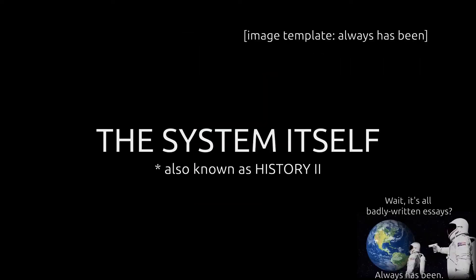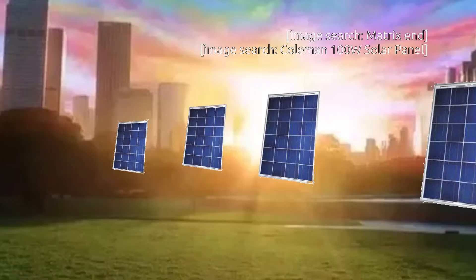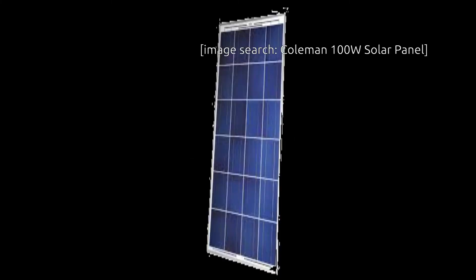Over the years I keep accumulating solar panels to fill up my windows. Sometimes they are on sale, sometimes I can spend extra money. I don't put my solar panels outside due to weather, insects, and theft reasons, but I probably could hook up extras and put them outside while I mow the lawn. It all started as a humble 100-watt system hooked up to a 12-volt battery, then I kept buying more and more. The windows can host three panels, so it's a total of 300 watts. During those times I could power a single gaming laptop for video calls for one to three hours maximum during a good sunny day, before the system complains of low charge.